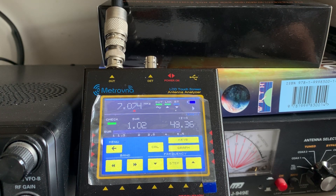Actually that was easier and quicker than I thought it was going to be. Just very quickly testing and analysing the antenna — how it matches on 40, 30, and 20 metres. I'm almost finding it quicker to match the antenna when changing bands on FT8 than waiting for the Yaesu to transmit, because I use 10 watts low power.